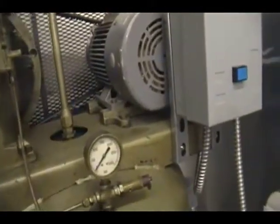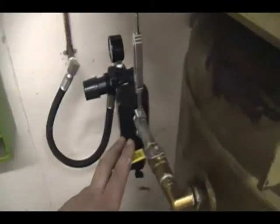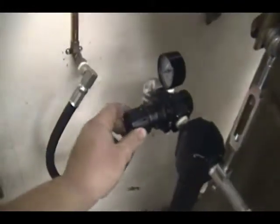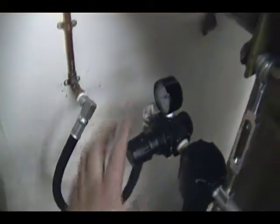I'm going to fire it up and let it build up pressure. Once it's built up to 160 pounds, I'm going to slowly open this ball valve. The gauge is zeroed out right now, then I'll raise the pressure slowly, listen for any leaks, and set it up to about 100 pounds. Alright, here we go.